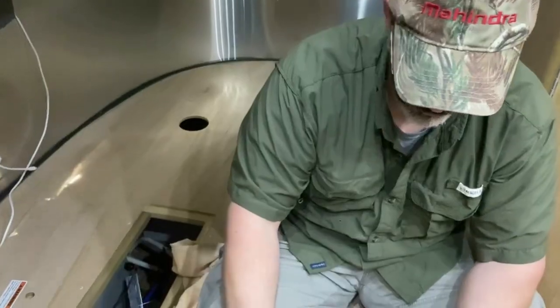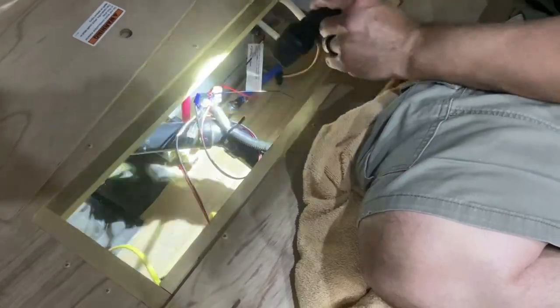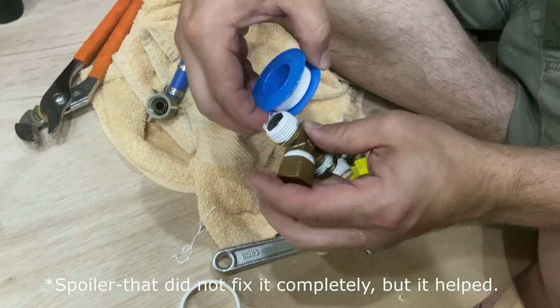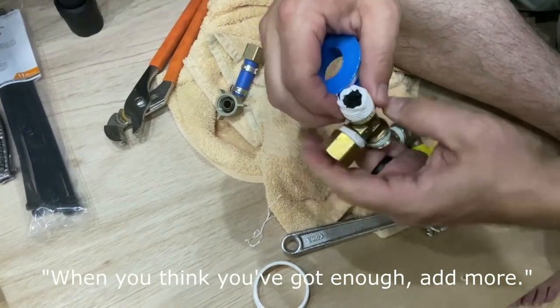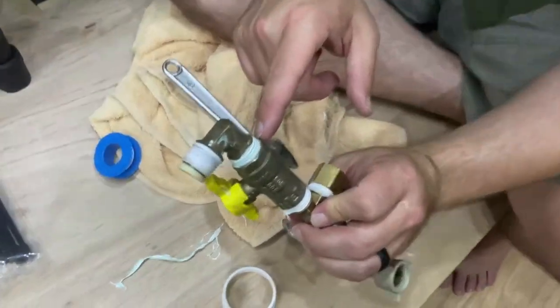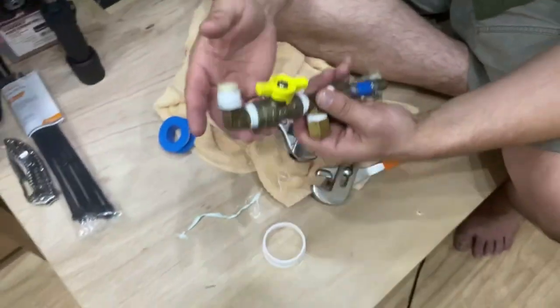Hear that squeak? Tell us what's going on here. We have a tankless water heater and found out that while we were running the water it's leaking. It was this pump, from these fittings. I'm having to take the threads off — unscrewed it from this piece — and re-tape it to see if that fixes it. You can see a little bit of discoloration around here, so there's probably been some water leaking out of that one too.